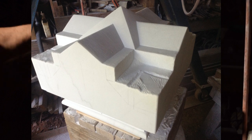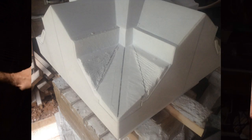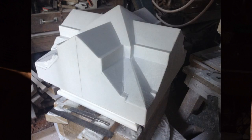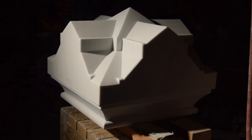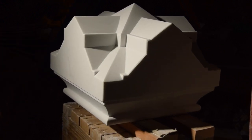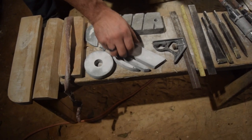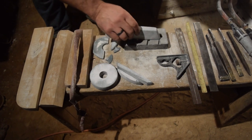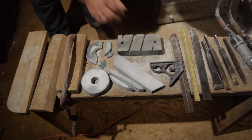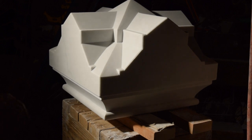So once those were all pushed down, we tipped them to create the ridge and develop these details and left a little bit of crown. And it's just a matter of slowly working it into shape. We did a little bit of sanding on the bottom, but the majority of everything was done with stones, with rubbing stones, just old pieces of grinding wheel that you save and you shape a little bit. You dress them into shape with the brick, just to rub them into shape, to keep them sharp. And you have to be very careful, because if pieces are brayed off and get underneath it, you can gouge the stone.